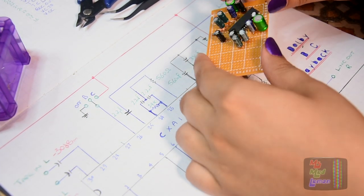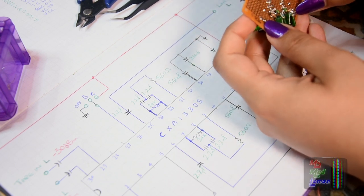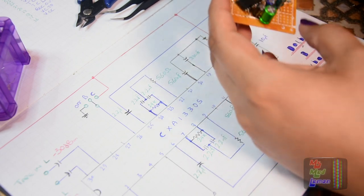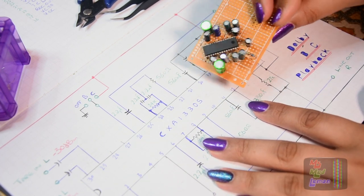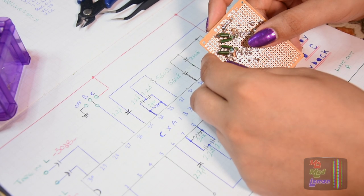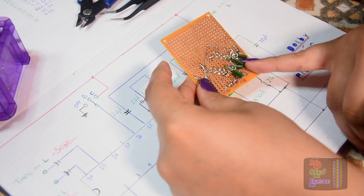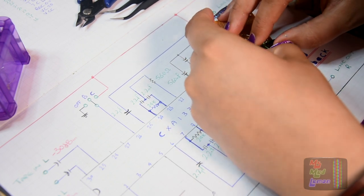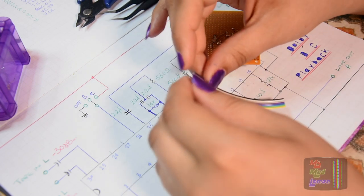Okay, so most of it, well actually all of it is done. So look, the inputs which are here, this pin and that pin. Combine the ends of these into one because it's switchable. Oh, this is pin 5, right? And pin 26 is buried under all this crap. Oh, we're going to have to, I'll just solder a wire to each point inside here. That sucks. Why didn't I do that before? I didn't know this monstrosity was going to happen, did I? Okay, let's make some contact.